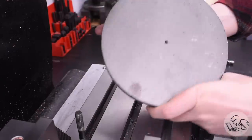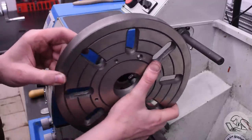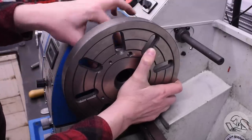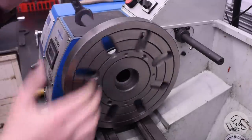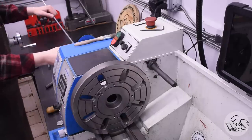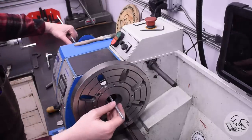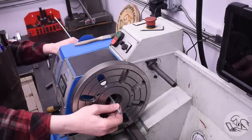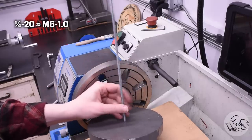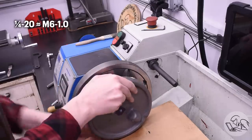This is tricky because the casting is much too large for any of my chucks, so this is a faceplate situation — all machining on this part will be done on the faceplate. The idea of that threaded hole is that you can use it as a drawbar to hold the part to the faceplate by going all the way through the spindle bore. This is a great setup idea. I wasn't convinced a single quarter-20 bolt in the center was enough to hold a big heavy cast iron part like this, but spoiler alert — it was.